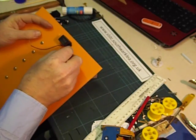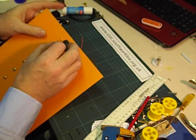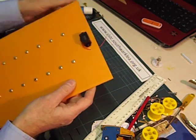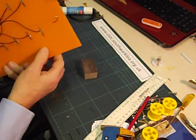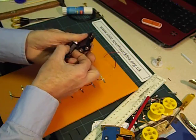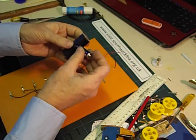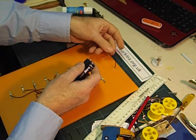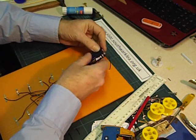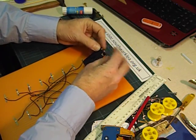You may notice that the buzzer has got a red wire and a black wire — there is a reason for that. Buzzers are what's known as polarity conscious; they will only work if you connect them the right way around. This is a three volt buzzer, so we're going to use a double battery holder with double A batteries in a twin holder, giving us three volts. If we connect it the wrong way around it won't work, but if we get the red wire going to the plus it will work.